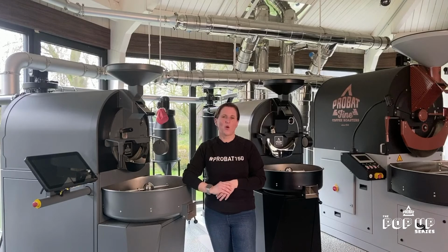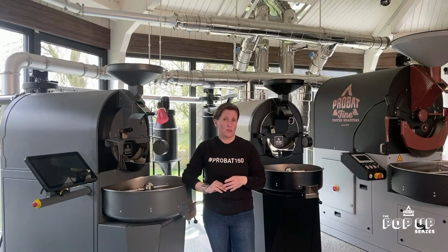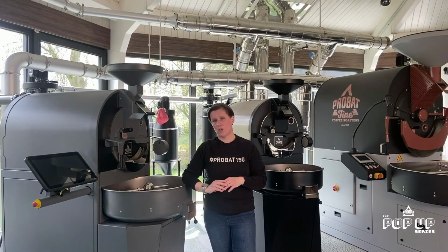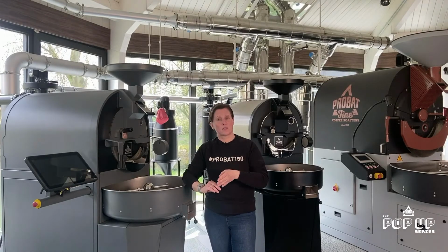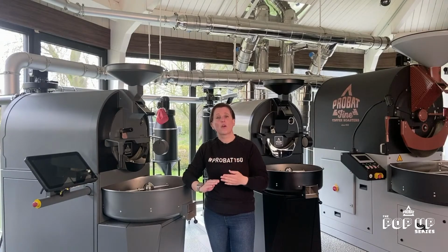If I would say no, it would not be completely right. There is no difference in the outcome of the roasting because our burner is adjustable to the gas that you are using. This is also the reason why, when you ask for an offer and later get the quotation, there's always the question from the sales team, what kind of gas will you be using? So that we can preset the burner to the gas type you're using, and then no matter if you use one or the other, the usage of this gas will be the same, depending on how the burner is set.